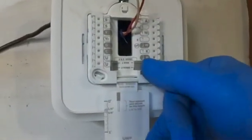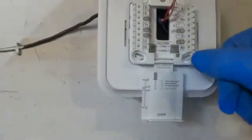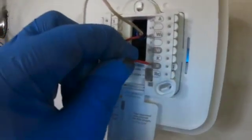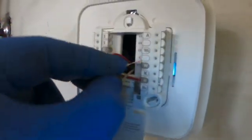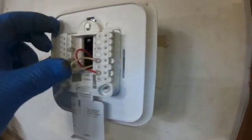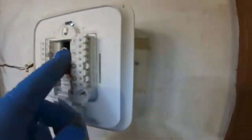Now I'm going to use R and W. Red is the power coming in, which is 24 volts, so I just push it in right here. You see the pin back here gets pushed down — just slide it all the way in until the bottom is out. Tuck this wire back inside like that. And then go to W, which is for the heat. As soon as it calls for heat, it sends power internally through the circuit board out W to energize the zone valve. I just push these wires down like that so they're out of the way.